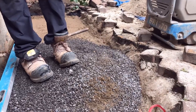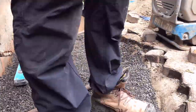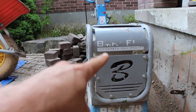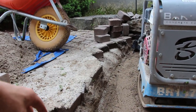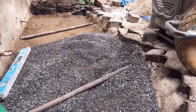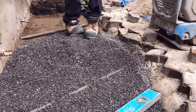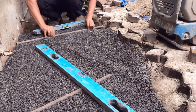What we'll do is take the height of the pavers — which is final grade — up to the height of this stoop, and divide that into three. It's about 19 inches total, so we'll go six and a half to the first step, then 13 inches to the next step, and then 19 and a half to the final step. We'll work with that final half inch by splitting it to a quarter inch on each. We ended up going six inches to the first step, six inches to the next step, and six and a half to that final stoop landing — so 18 and a half inches total.